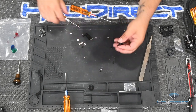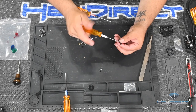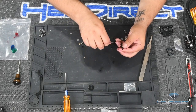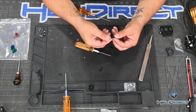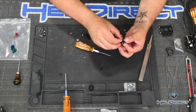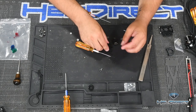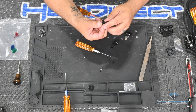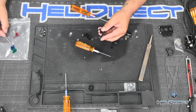Now that that's loose, we're going to go ahead and pull the bolt and pay attention to which side the number's on. On the top, I'm just going to match the way they have it laid out in the manual. I want the side with the 1 facing me, and then our bolt head will go through here. Then I'm going to do that same trick with the Loctite I did before, where I basically just back the screw out and then use our awl to get some.